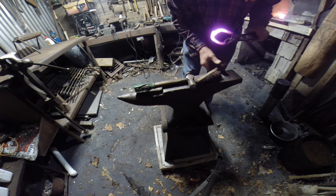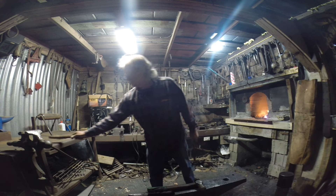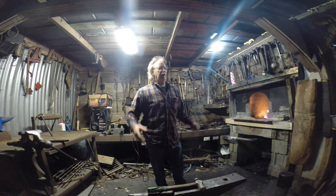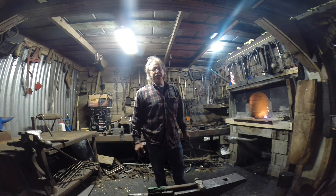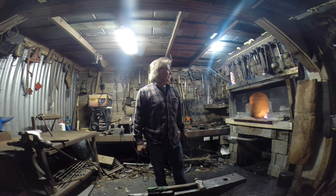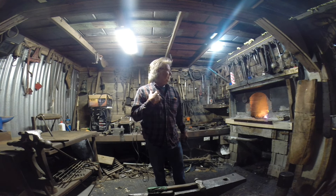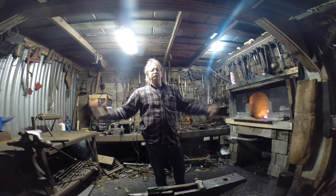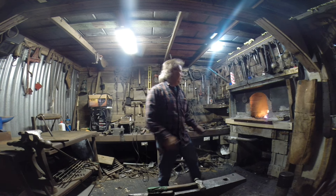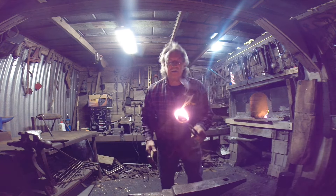You'll see me go hotter than the welding heat should really be most of the time. When you see all those sparks flying, that piece of material is actually burning on the outside, so you have to really train yourself. I'm out here doing videos showing how to do this stuff, but if you go way beyond the welding heat — you know, got a literal sparkler flying there — that's too hot. You want to see little sparks or no sparks.